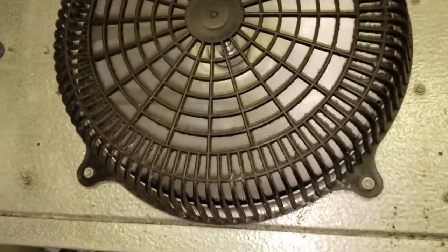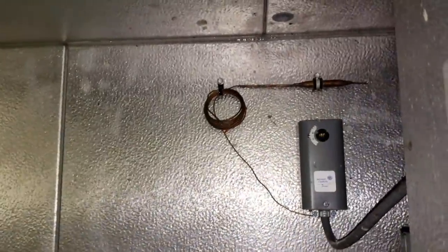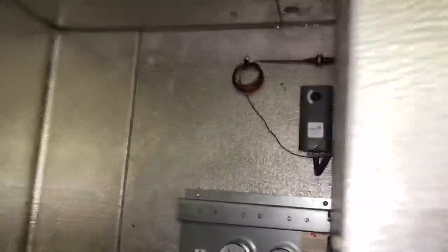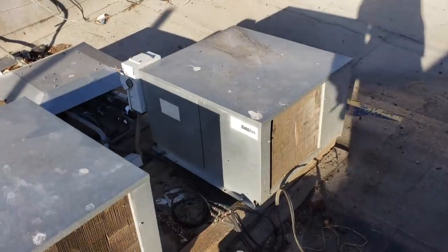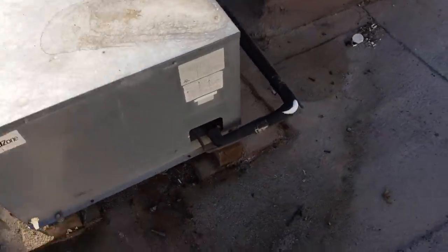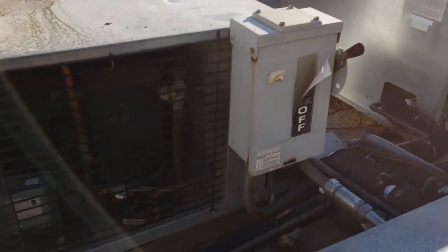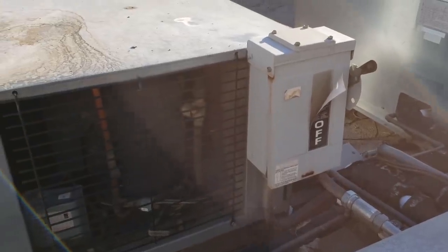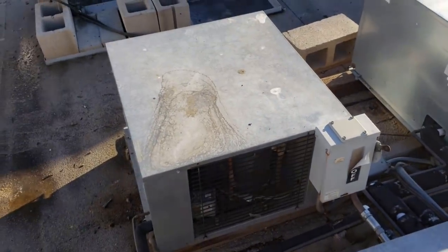Service calling a beer walk-in. Back in there, it looks like it's all iced up. We're going over here to this thermostat. So we're going to get the condensing unit shut off - my condensing unit right here. As you can see, we've got ice going to the compressor. So what I'm going to do is just shut off the condensing unit right now and let the coil defrost while I'm checking everything else out. I'm going to look at the defrost clock and all that good stuff.